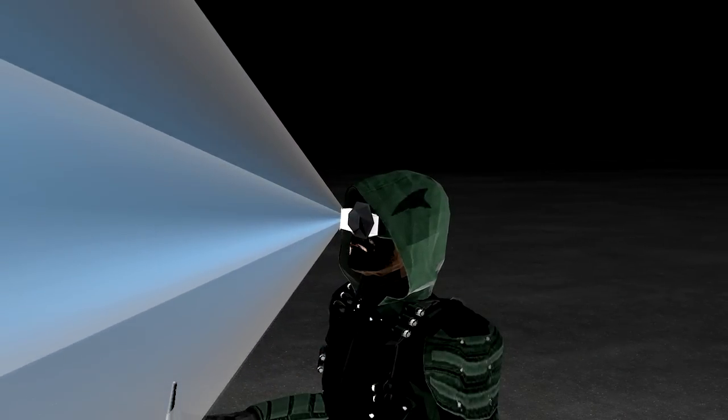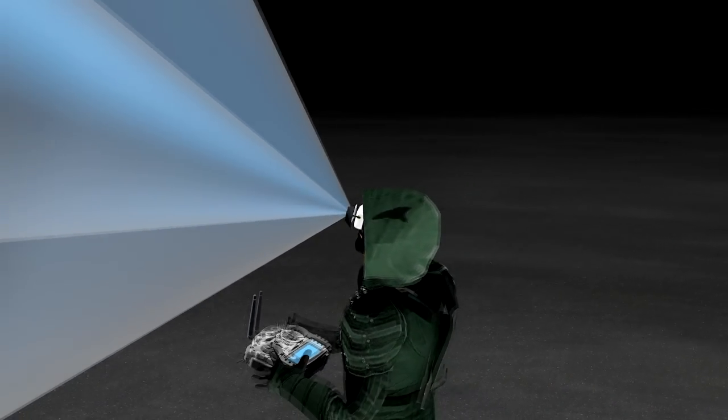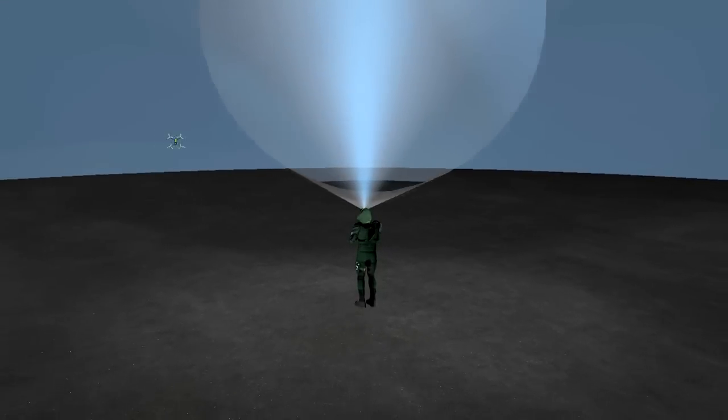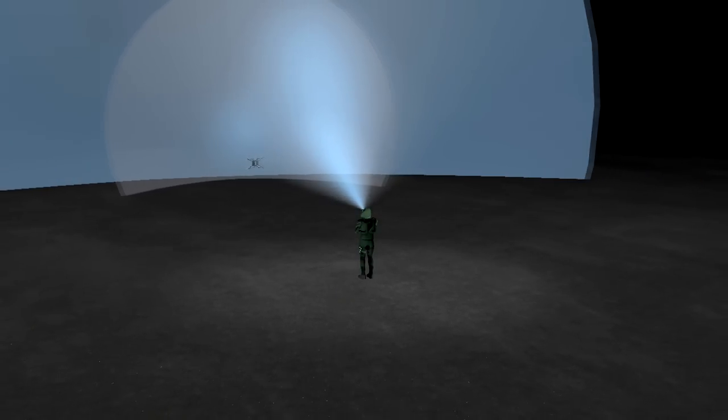Here we have a pilot with two beams. The narrow beam coming out of the goggles represents a high-gain antenna like a 16 or 17 dB patch, and the wide beam is something like the Crosshair Extreme. As the pilot moves their head back and forth, that beam changes, and the quad gets outside of the narrow beam but not so much the wide beam. So omnidirectional antennas should be mounted vertically, and directional antennas should be chosen based on how much you do the Stevie Wonder — because high gain means narrow beam, and if you move your head a lot, you'll steer that beam right away from your aircraft very frequently.